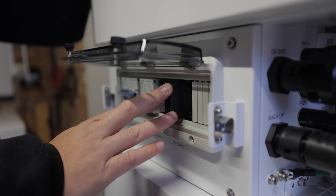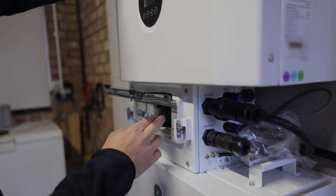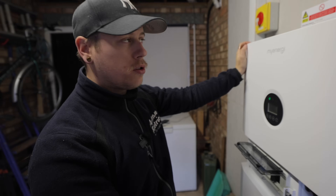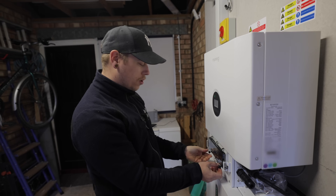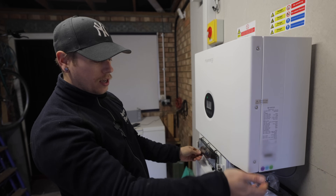You can also install solar direct into this inverter. There's a PV switch and some MC4 plugs so you can connect two strings to this. If you wanted to install this system just as the battery for the time being, you can always have your solar installed later and hooked up to it.